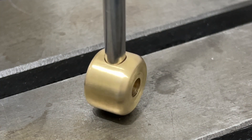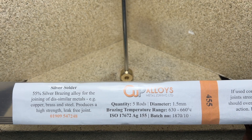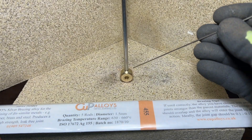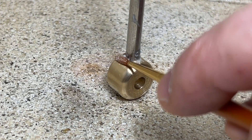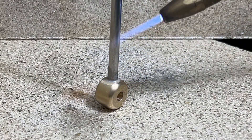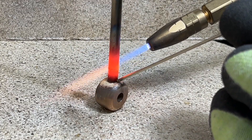On one of the bushings I drilled a shallow annulus around the 5mm rebate using a 5.5mm twist drill to encourage some of the brazing filler metal to occupy the interspace to hopefully increase the strength of the joint. The brazing stage is the one I find the most challenging to execute satisfactorily. This is a skill set in its own right, which takes a lot of practice to become proficient at, so the odds are stacked against the amateur hobbyist. I'll use this 55% silver brazing alloy which I previously deployed when making my Red Special truss rod. The first job after degreasing with isopropyl alcohol is to make up a flux paste using borax flux powder and apply this to the zone to be brazed using a fine detail paintbrush. I carried out several practice runs before brazing the two tremolo arm assemblies. None of my attempts are worthy of showing in detail, so I'll just illustrate the process with some heavily edited sequences.